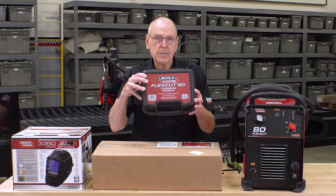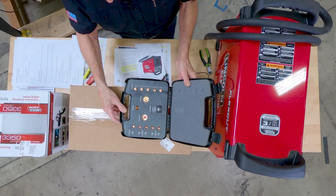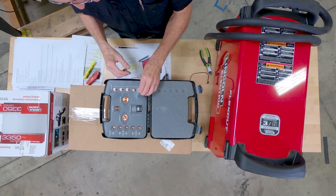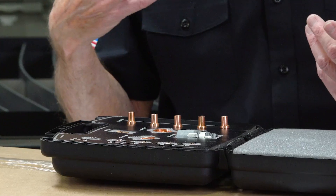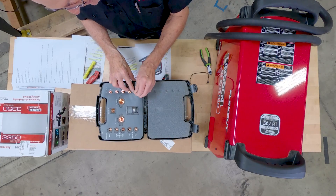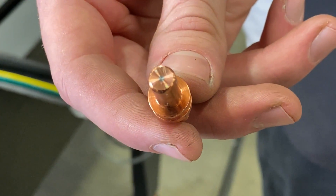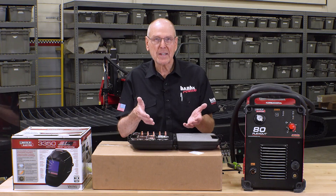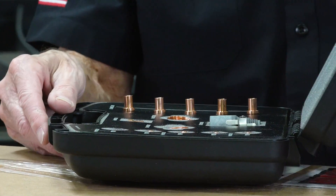The next item is our consumable starter kit. The consumables have to do with the formation of the plasma — you've got nozzles, swirl ring, and electrodes. The cool part is that these last three times longer due to patent-pending technology. One thing I think is especially cool is that the electrode has a hafnium core in the center, which contributes quite a bit to electrode life. It's like this stuff is based on their 125-year history of patenting new art — there's a lot going on in the consumables area.